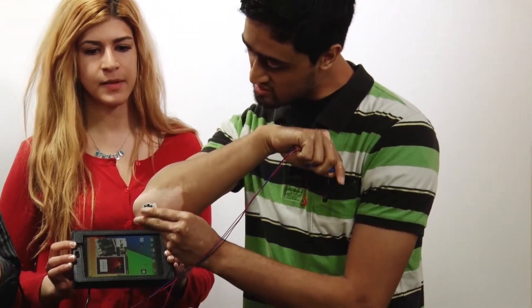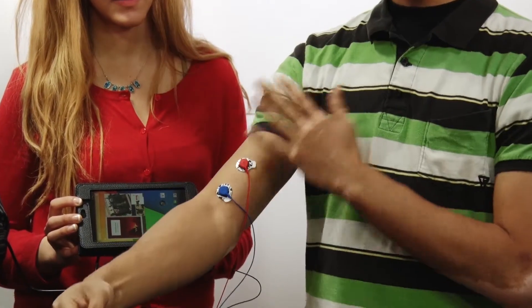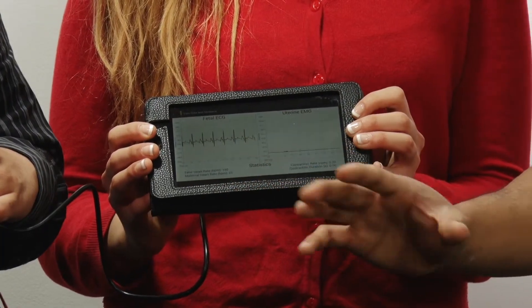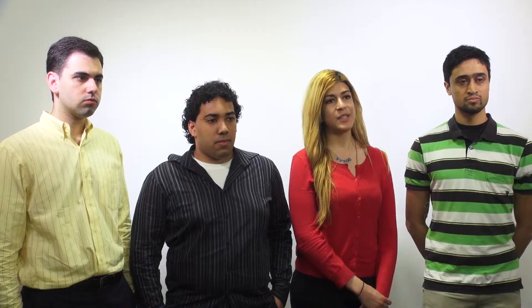The first step of the procedure is using low-cost portable electrodes that measure the changes in voltages across the human skin. These then go through a simple hardware filter system, which goes to the Arduino, which does some packeting and then sends it to the Android tablet for further filtering. We decided to exploit the computational power of the tablet and do most of our filtering there. For the uterine contractions, we knew from literature that wavelet filtering was most suitable, but after implementing it we realized it was slow, so we settled on a low-pass filter.